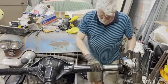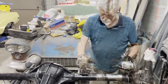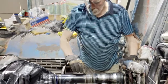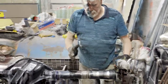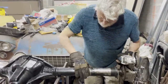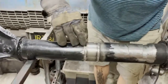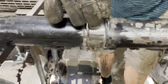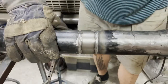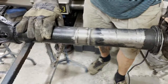Let me explain what's going on here. We have tack welded and adjusted, and then I have welded a bottom weld — as I call it, a bottom weld — all the way around. Then I grind it out with the angle grinder because I want to prepare the space for welding with a stick welder. As you can see, we have a weld going all the way through to the bottom, and that should be a good base for the next weld. We don't want any holes, cracks, or damage down there because we want it to last forever.